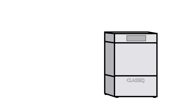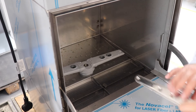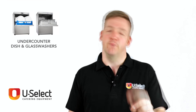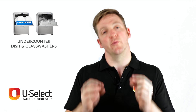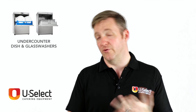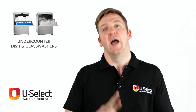They all come — both the standard and the duo — with an air gap, which means water can't flow back up the pipe, as required by legislation. It's a very solid piece of kit and works very well. They're easy to take apart and easy to clean and maintain, which is important. One important thing to remember with the standard: they do not come with a water softener. If you're working with equipment that uses water, you must always check whether you're in a hard or medium water area, and if so, you need water softening.